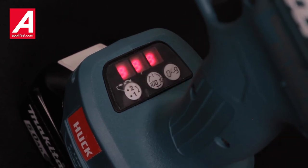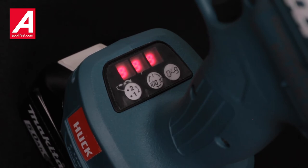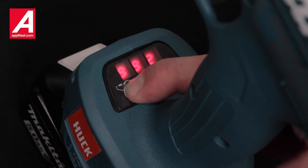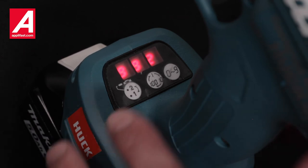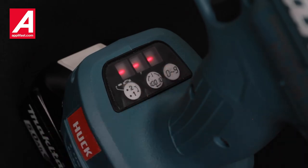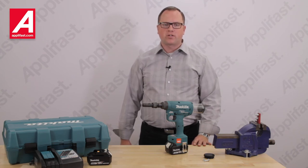Press and hold button number one to adjust the pulling force value. This will cause the third digit to begin blinking, indicating that you are in adjustment mode. The blinking digit can be changed by each press of the button beneath it. The second button can be used to select which of the three digits is to be adjusted. Then press and hold button number one to lock the chosen setting. You can then press buttons one and three simultaneously to lock the adjustment setting screen. Recommended values are available to provide the operator with a starting point to adjust for ideal pulling force to suit different fastener applications.